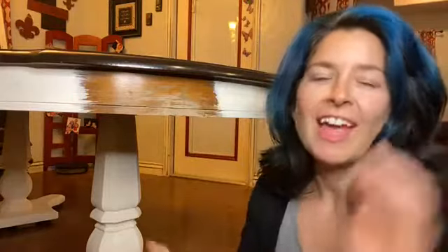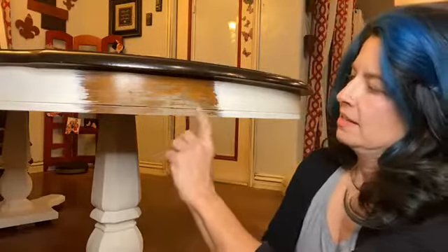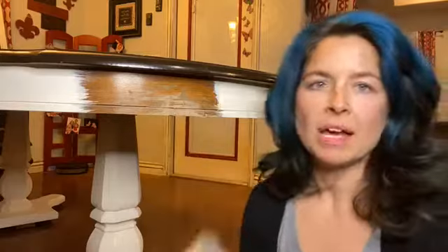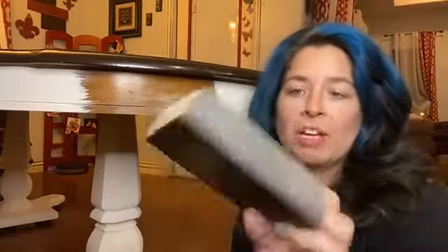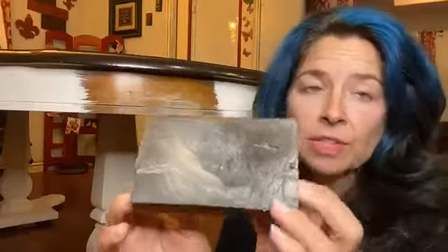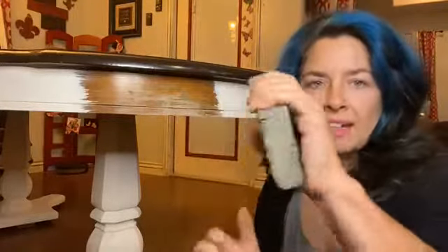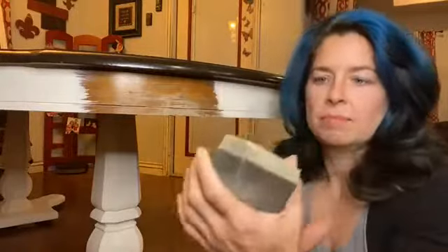Here's our extremely massive dining room table and it is this close to being finished. The mud is dry and I'm going to sand it back using the same sponge that we used the other night. I've used it on literally I don't know 50-75 jobs — I just keep using it. If I wanted to I could put another piece of paper over it with a higher grit and still have the grip of the block, but it's good for what I need it to do tonight.